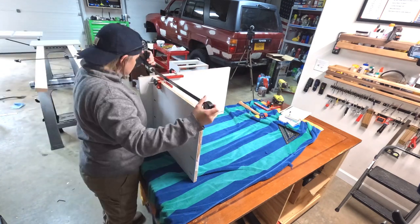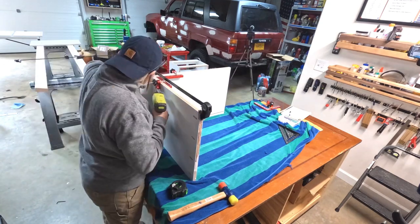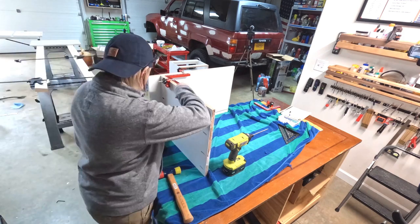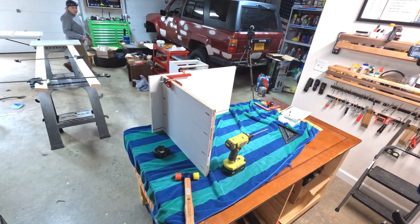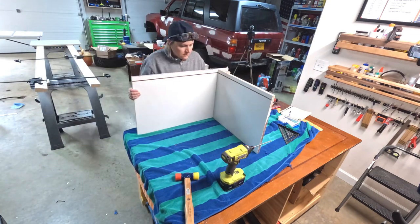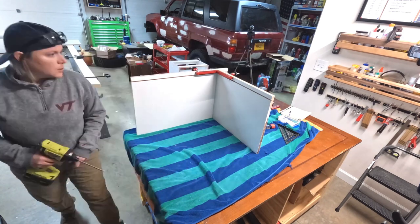Now, I have to confess that when I first started dabbling into woodworking as a hobby, I would sort of just eyeball everything when it came time to assembly and clamp things as flush as I could get them, and then screw my pocket holes in. While this might work for some joints, I learned the hard way that, you know, sometimes shift happens. My pieces would shift around just slightly and things would no longer be square.